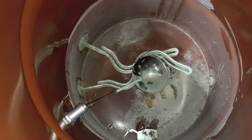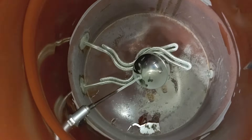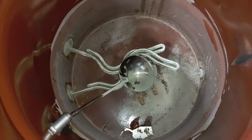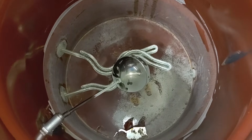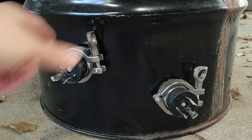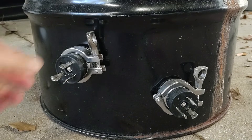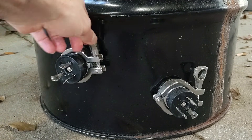Inside your barrel, you have a stainless steel float valve and two heating elements. I chose two because I wanted more power — I wanted my trough to heat up faster, my runs to be shorter. I have to make a lot of blocks and I need to do it quickly. Each one is 5,500 watts and it's 1.5-inch NPT holes that you drill for these. I've used sanitary fittings — some people call them brewer's fittings. It really was as easy as pushing this against the weldless bulkhead fitting and screwing them together.